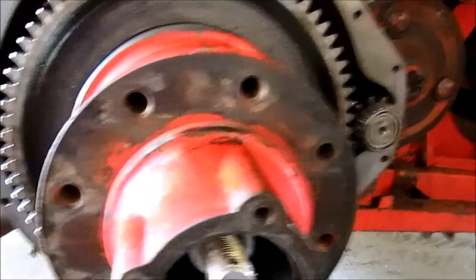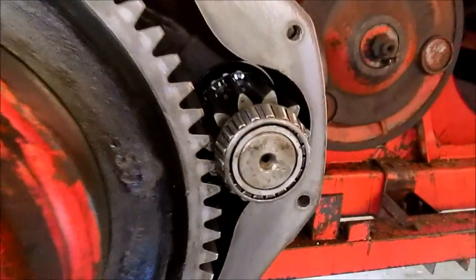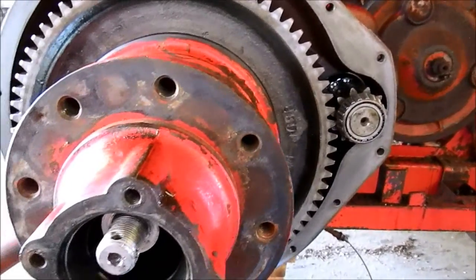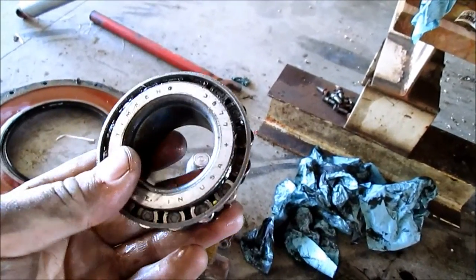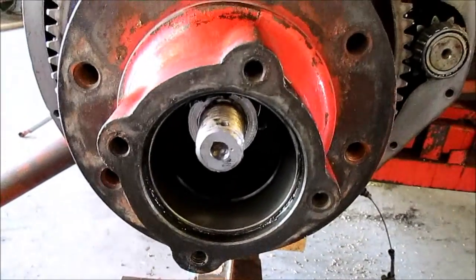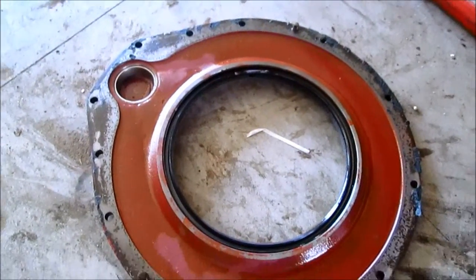Progressing on this final drive, I got this all reinstalled somewhat. These kind of have to slide in sequence together to make the meshing correct, and then it slides on to the rear inner bearing. This outer one — I believe I said in a previous video that they run in oil — but in the book it says to pack this one with grease, which is the outer one here. Oil obviously couldn't get to that, so we're going to pack this with grease and then reinstall everything and start sealing it up. I have that gasket on order for that hub cap, and then this is the plate that we borrowed from the 550.